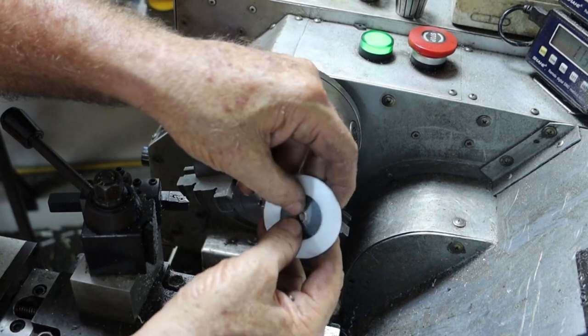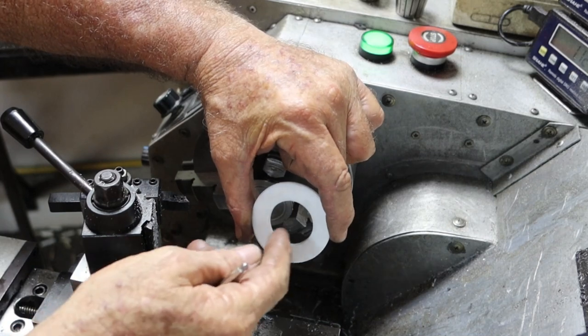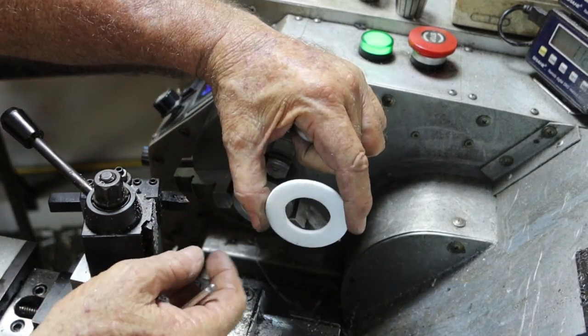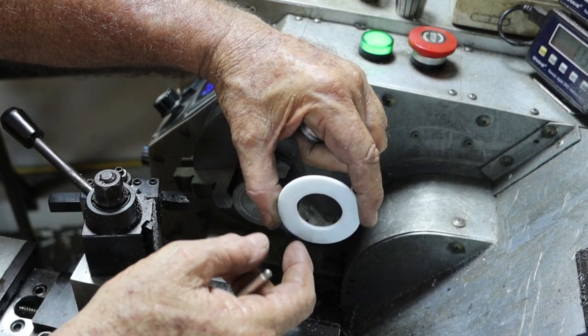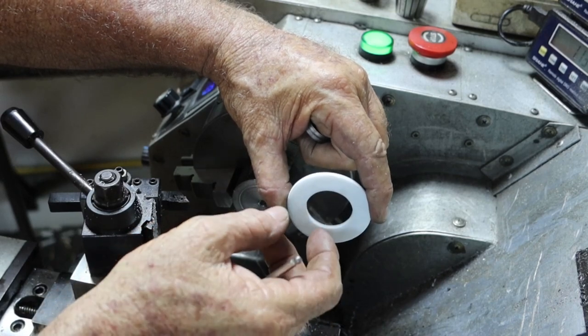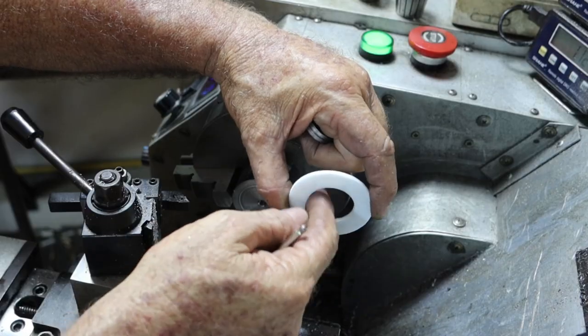That's just how I had it — just fits on there. You don't need to see me do the other one. How I intend to bore the center out is to try and glue it in place, bore the arbor and just bore out the two millimeters I need. If that doesn't work I'm going to drill them in maybe three places and use some little M3 countersunk screws to hold them in place while I do that.